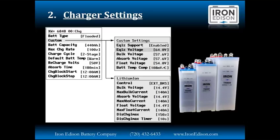That's at the bottom right, discharge current max or discharge I max, which allows us to program the percent capacity that we can surge, as well as a timer. Again, this would be useful for starting up an air conditioner or a heavy load where we can draw a lot of energy quickly from a lithium battery, but not so long as to damage the battery.